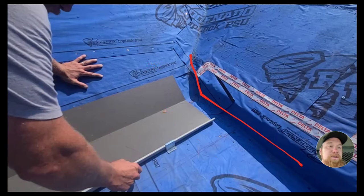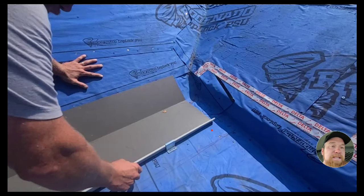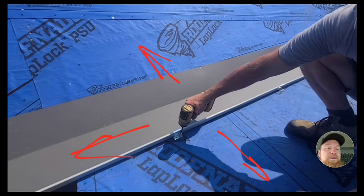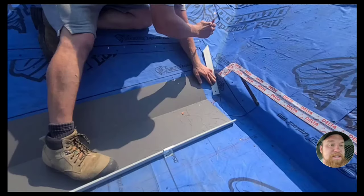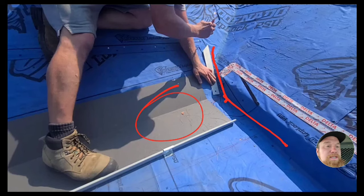How do we get our miter line drawn and transferred from here over to here, across the top of this panel? That's what I want to show you guys today. I use what's called the step off method. What I'm doing here is securing the panel so it doesn't move on me in either direction — a good practice for doing miters — to be able to draw in the line using your pencil exactly where you want this piece to end up.